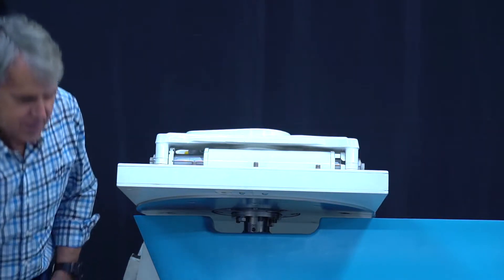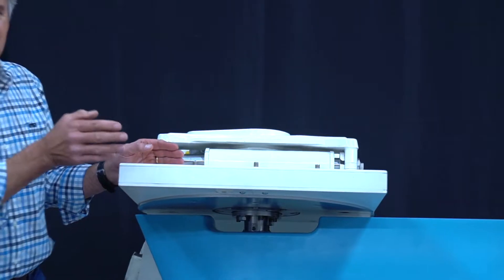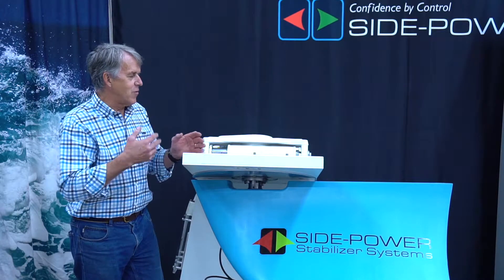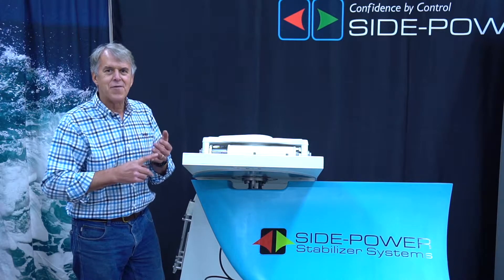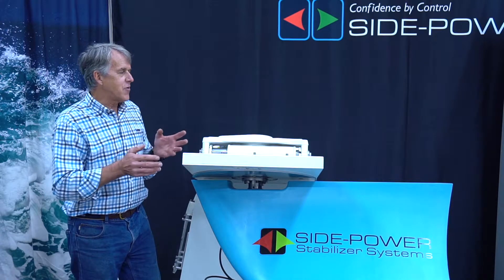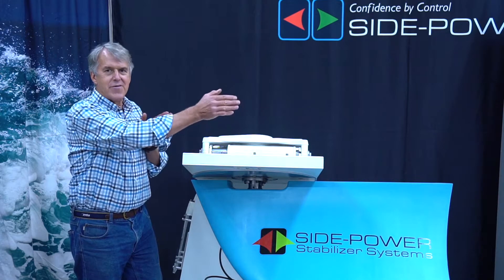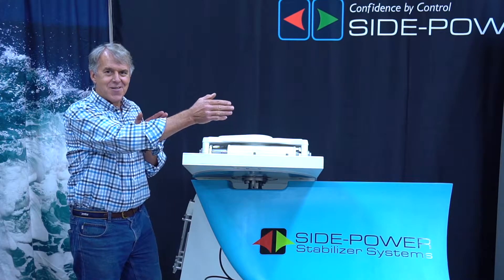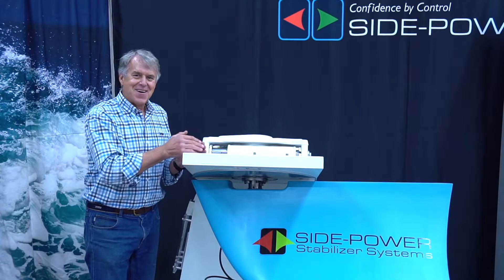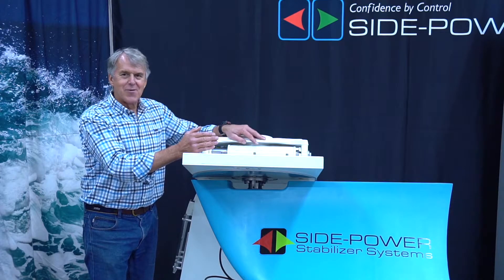We have previously indicated on the hull where the fin needs to be positioned when the system is turned off or when you're going in reverse. If you lose pressure, the system will automatically turn off — in those conditions, the fins are parallel to the keel. We've already laid out where that is with chalk marks on the hull. Because this is a refit, let's pretend we're putting the fin in exactly the same orientation relative to the actuator that we took it off.